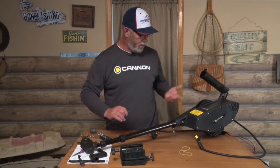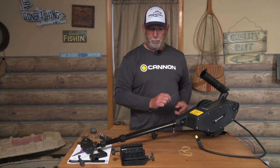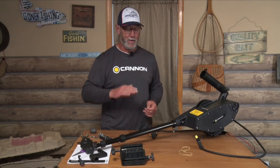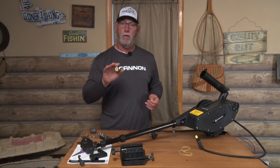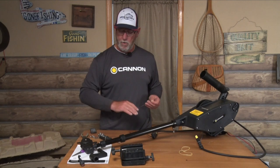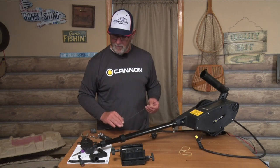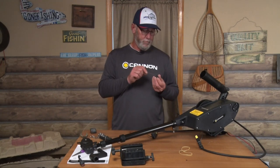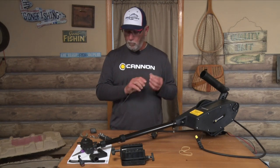We have our downrigger wire run through the pulley. Now at this point, if you're going to add a retro retrieve, which I highly recommend, this would be the time to put it on. Slide it on now, that way you don't have to take the pulley system on the retro retrieve apart to assemble it on your cable. We're not installing a retro retrieve today, so we'll go ahead and just put the terminator kit together. First thing we want to do, slide the boot onto the cable.